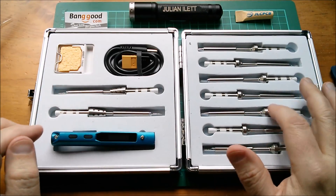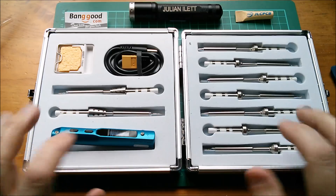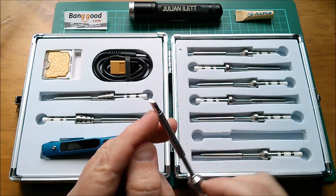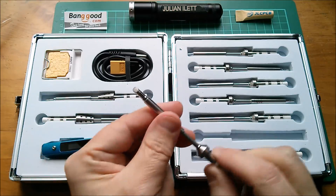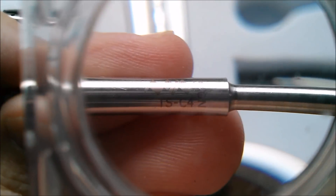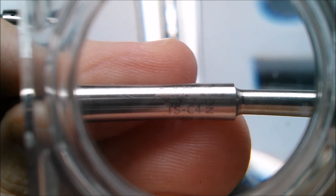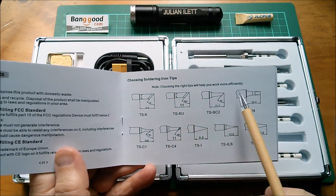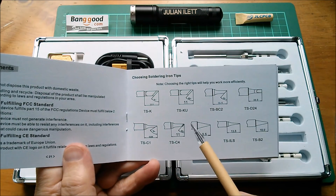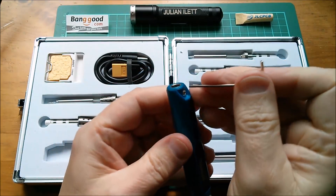What I think I might do is pick one of the very large tips because I've got a particular job I want to try this soldering iron on — I really struggled with it the other day and it'd be a very interesting test to see if this can do it. I'm going to use this tip; it's got a very large diameter sort of wedge-shaped, 45-degree cut tip, clearly designed for very large item soldering. The model number is TSC4. Looking at the manual page on choosing soldering iron tips — it says choosing the right tips will help you work more efficiently, doesn't say a lot — but the TSC4 has that massive large diameter tip, 45 degrees, 11 millimeters.